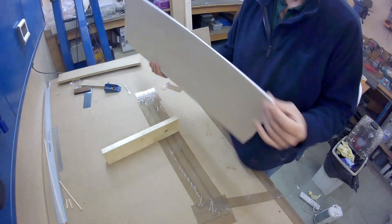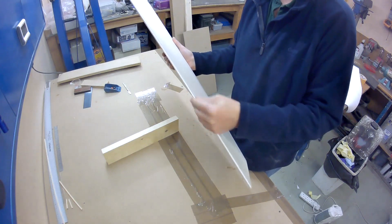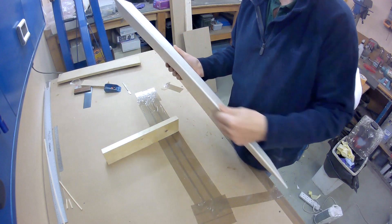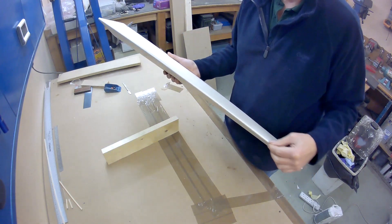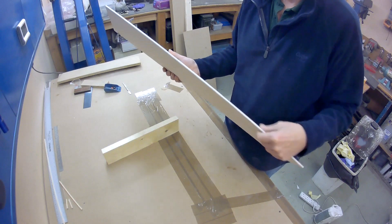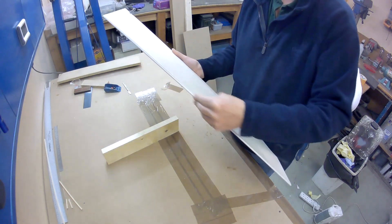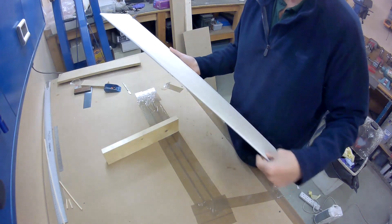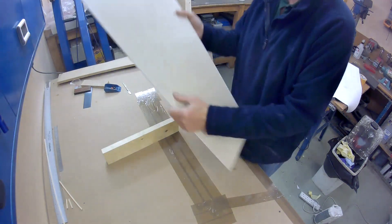It's very slightly rounded. I didn't make it hard and square but I haven't made it a complete semi-circle either — I have rounded it a bit. Sharp corners tend to get knocked, and paint tends to flake off, which can be a problem in service. So I've just put a slight curve on there and that should help stop that from happening. A whole lot will need to be sanded and finished anyway.